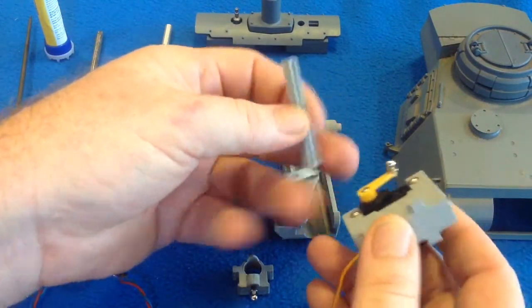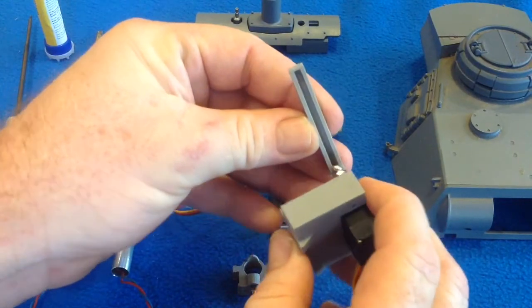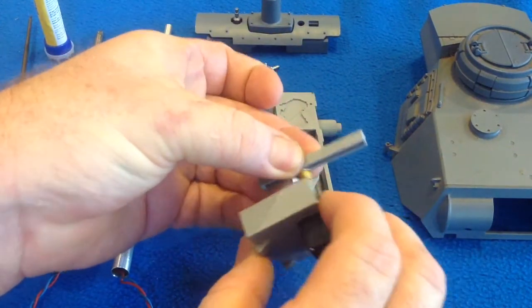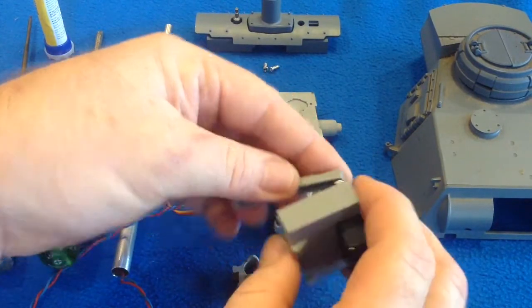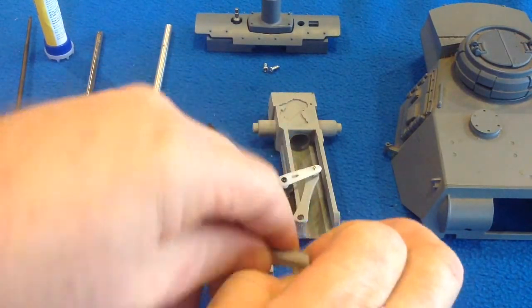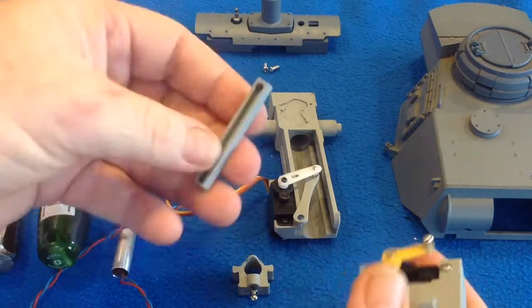If you are using the elevation servo, it's meant to fit a 4mm ball. You can see there's a round hole there — you pop the ball in and it just slides up so it can't come out and can't slip off, but still has movement up and down. The fittings should be firm — they shouldn't be super easy to remove because you don't want them coming out all the time.